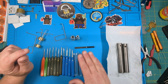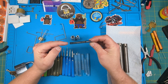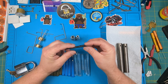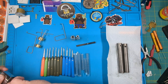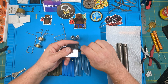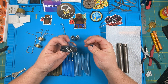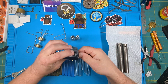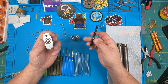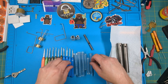Preparing for this I made this last night. It was a piece of bar steel - about 7mm - and I drilled a 5mm hole in it, then ground it off. This is a disc turner for when I get ready to start picking the Abloy Classic and the Profile - you have to turn the discs, so I made this to turn all the discs in one direction. I believe I can also use it on the Classic since that half-moon shape is more like a C-shape or smiley face. I also ended up bluing the metal just to see what kind of look it got.